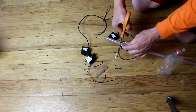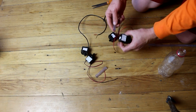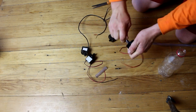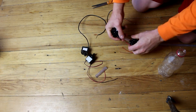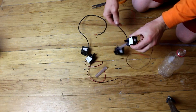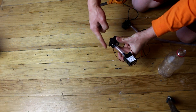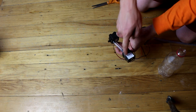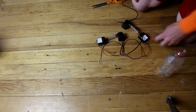I just need to cut a couple pieces of this tubing - it's 7/16ths outside diameter plastic tube. I'm going to stick this in the inlet of one pump and on the outlet of the other. What's going to happen is this pump is going to suck in some of the liquid, spin it up and pressurize it down the tube, and then the second pump is going to take that, spin it up and pressurize it a little bit more.